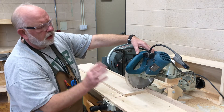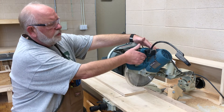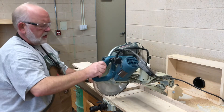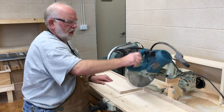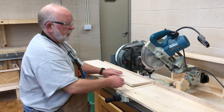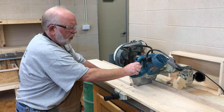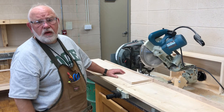There's also a light on here, but we don't need it because we have plenty of light. This is called a sliding miter. Some of you have what's called a chop saw — the only thing it does is go down. But a sliding miter allows you to cut a much larger board, though it costs quite a bit more. You can push the saw forward to get through the board, or on wider boards you can start at the far end and pull it through. Which way works best is a personal choice.